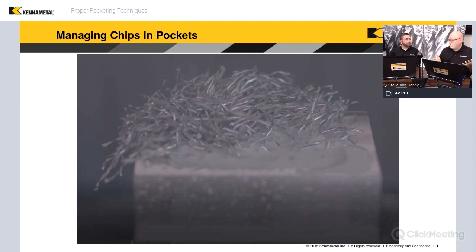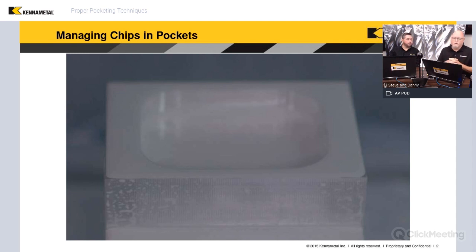We then did that same pocket with our Core 5, which has through-spindle cooling capability, and got a completely open pocket — no chips at all inside. Something to consider: whether on a vertical or horizontal machine, make sure you have a good coolant flow through the spindle if possible. If that's not possible, make sure coolant nozzles are positioned directly. Even in our own shop, we have to pay much more attention to our coolant analysis.